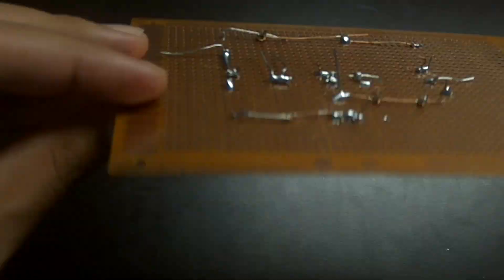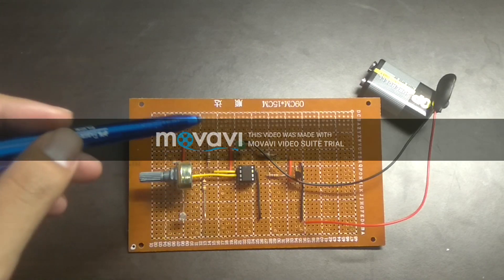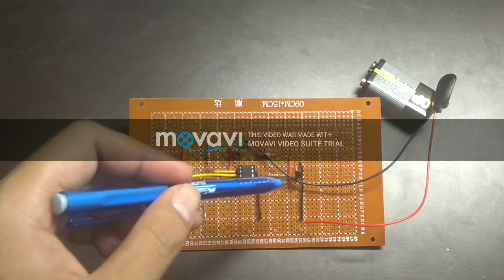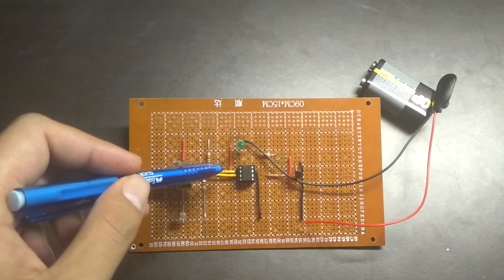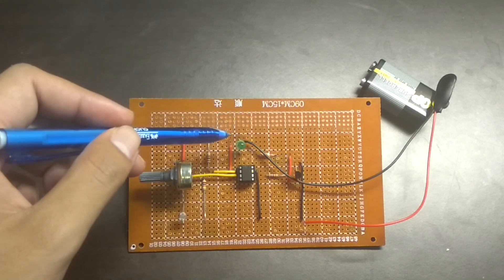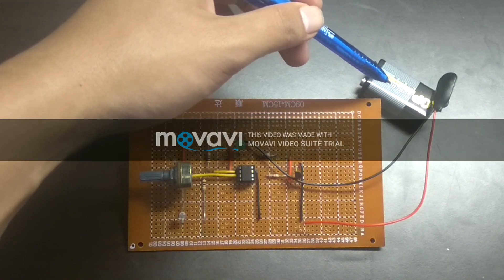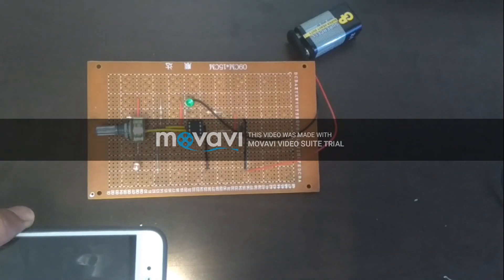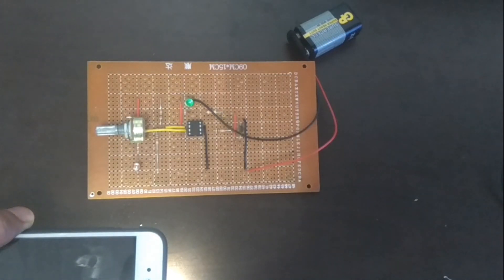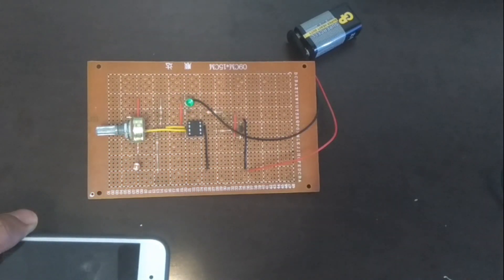This is the result of the circuit after completing the soldering. The components that we use in the light detector using the Wheatstone Bridge are: an LDR, resistors of 10K ohm (1, 2, and 3), a resistor of 330 ohm, the IC UA741CN, and the last one is a green LED. We also use a 9V supply. As the flashlight is incident on the LDR, the LED starts glowing. If there is no light, the LED remains in the off condition.